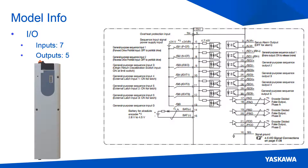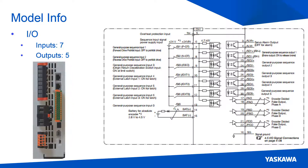The servo packs come with 7 inputs and 5 outputs available through the CN1 connector. Three of these 7 inputs can be implemented as high-speed latches to capture the encoder position of the motor. These high-speed inputs allow time-critical information, like registration marks, to be seen and processed by the servo pack. The 7S and 7W models both have the same numbers of inputs and outputs.